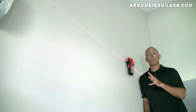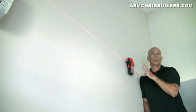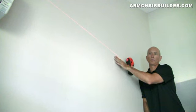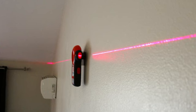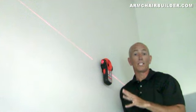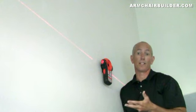We're going to use this laser level to create our starting line about midway up on the wall. We're using our layout created with the grids to show exactly where we want to start, creating a straight line to work down from and up from. We're also looking at the wall as a whole to create as many full squares as possible, minimizing waste and cuts.